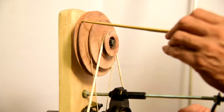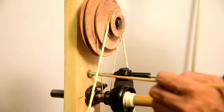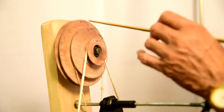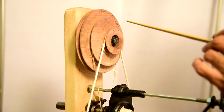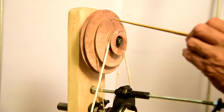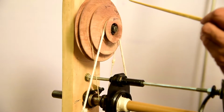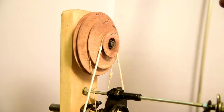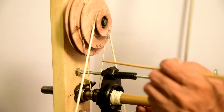126 mm diameter step pulley can also be mounted with this hub, but at a time one belt can be used. While using the 126 mm diameter groove on the hub, the RPM will be 3200 per minute, considering the band wheel moves at 50 times per minute. On the other hand, the 96 mm groove connected with the hub moves 2441 times, that means 2441 RPM of the spindle, and the weft yarn can be produced easily in this groove.